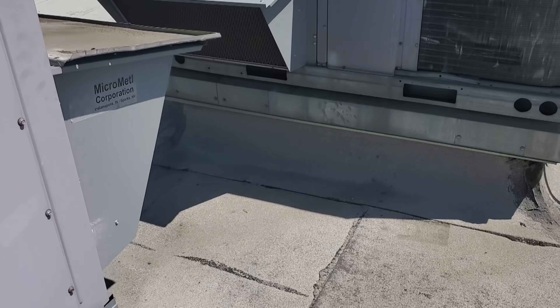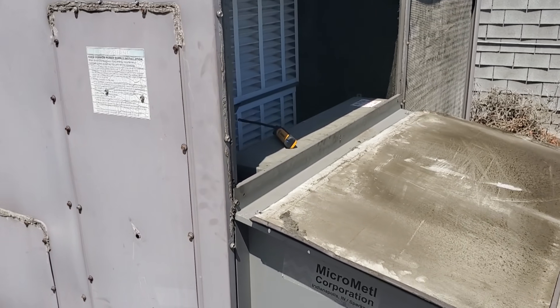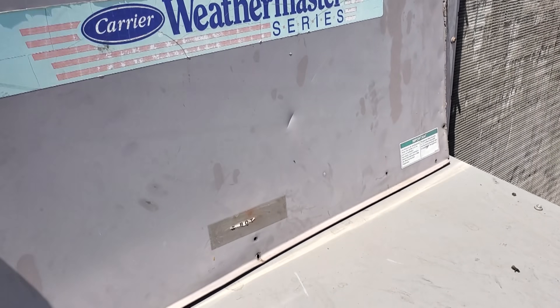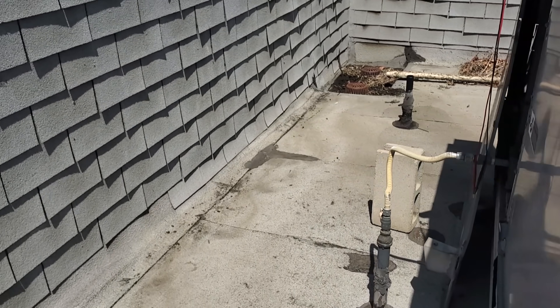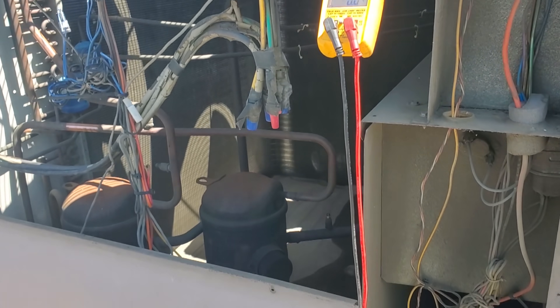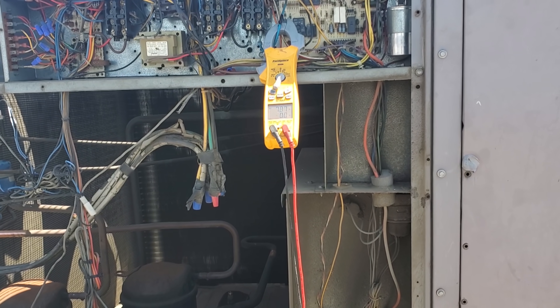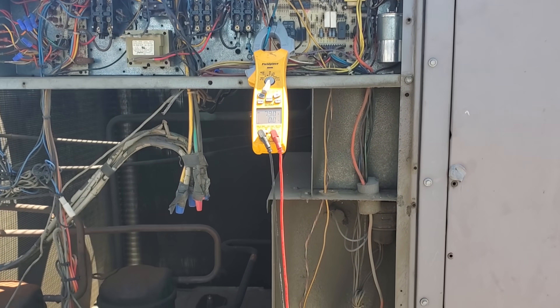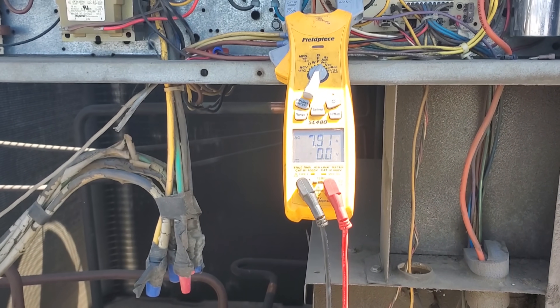What we need to do is walk right over here. This panel is still off, guys. It's so important to make sure the panels are on the unit when they're running. If you're trying to do a PM on a unit and you have a panel off like that — now that's just half-assed on, but it's probably good enough — it's going to affect the operation of the blower motor. Notice how the current draw dropped immediately and it's still dropping. I'm going to put that panel on the rest of the way. Same thing would happen if we had this panel off. It's set up to run under a certain static pressure. And if the static pressure is too low, the motor theoretically could overcurrent. And that's what was happening — it was too easy. There wasn't enough resistance across the ductwork and we're overcurrenting because of that.